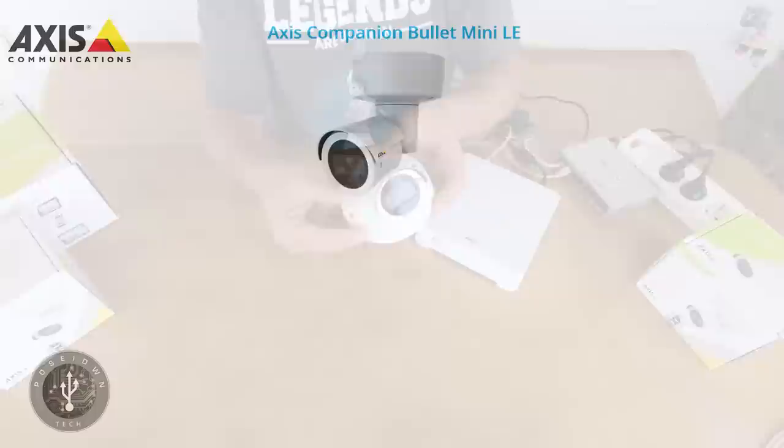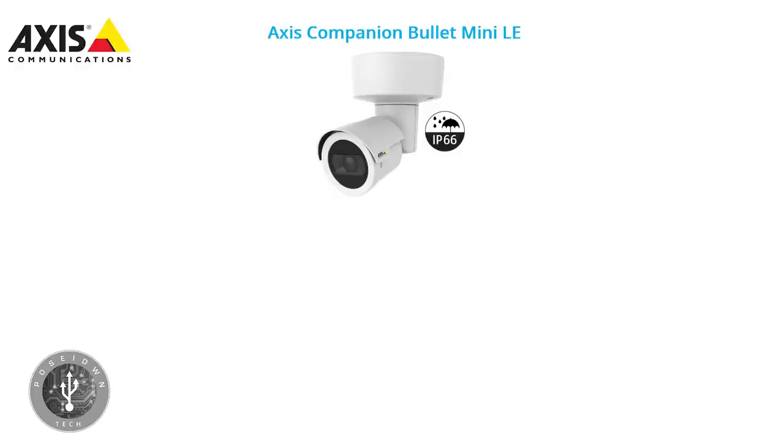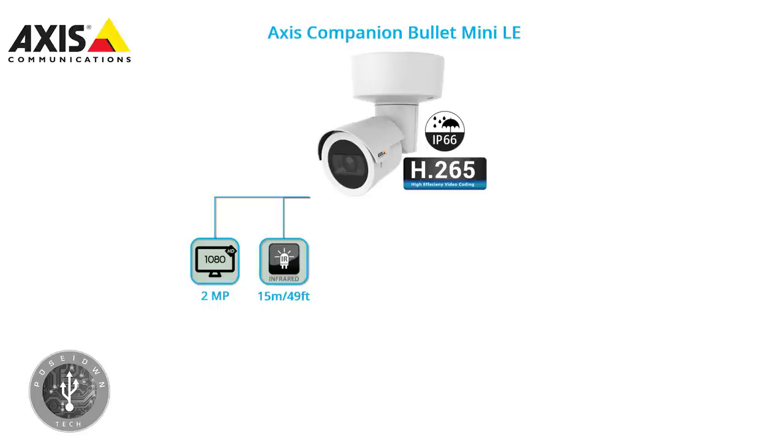Axis Companion Bullet Mini LE is an outdoor-ready IP66 camera that supports H.265 compression with high video quality in HDTV 1080p and 2 megapixels resolution. It has built-in IR illumination up to 15 meters for surveillance in total darkness. With WDR technology, it delivers high image quality even in scenes with complex light conditions. It features power over Ethernet that allows one cable to provide both network connectivity and electrical power.